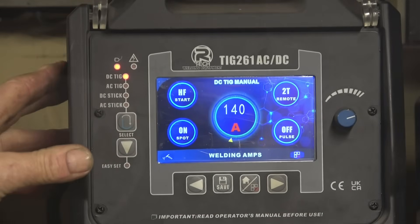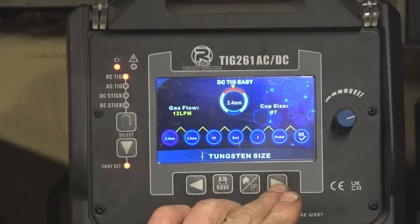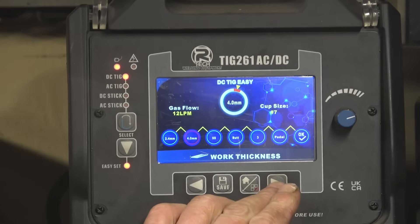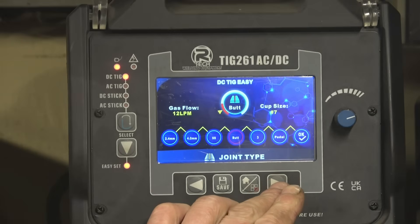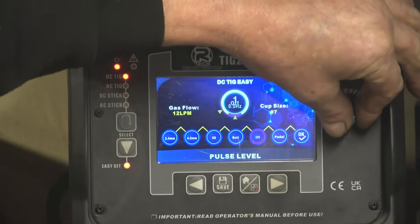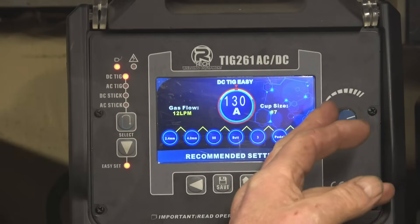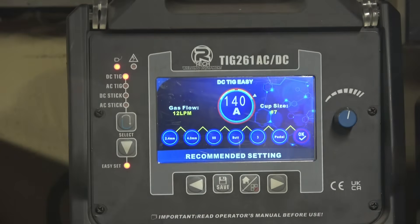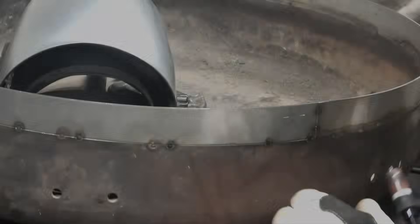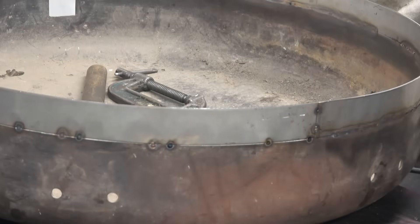That was the setup for the spot welding. Now we're going to go DC Easy Set — 2.4mm tungsten as normal, welding 4mm material, it is stainless steel, it is a butt joint. I've got the pulse set to 3Hz because I know that works. You can change the pulse on the preset menus, but 3Hz — which is actually 2Hz — works very well on this job. I'll try and get a shot through the welding mask. I've got 10% either way on the amperage and I'm going to tweak it up to 140 amps, because I am using a pedal and I can back it off if I need to. Now we're going to be doing the fusion weld — there'll be no filler material going in, just a straightforward fusion weld because there's no gap; it's a nice joint.